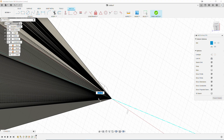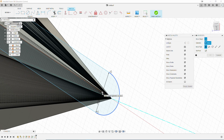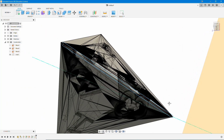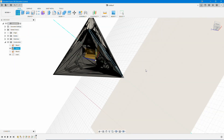Once we do that, we're going to drag it off. I like to make this at 0.5 millimeters, and as you can see it extends a little past the die. So we're going to click on the center reference point, hit M for Move, and slide it up just a little bit. This doesn't have to be perfectly even — it can extend a little bit, but you don't want it too far up the die. Check that other edge just to make sure everything is where it's supposed to be.